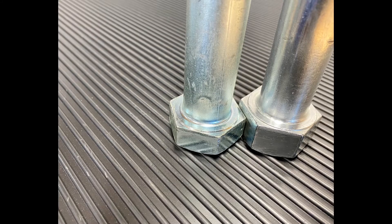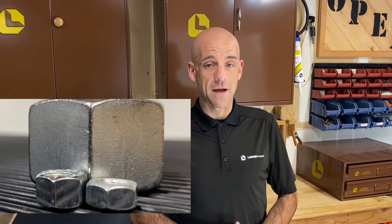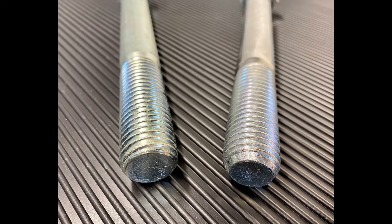A couple of my favorite features of this maintenance-engineered process are the higher hex head — because when I need to put a wrench on something, especially when it's out of position on a piece of equipment, it's a little bit easier having a little more meat to grab that wrench onto. And how about that chamfered starting point? That's really going to help ease the situation when you're working with larger or smaller fasteners, especially out of position when you can't see what you're threading onto.